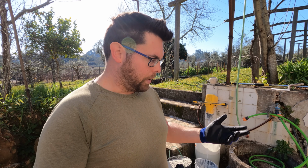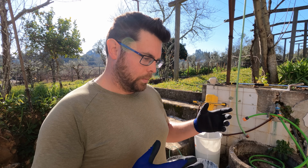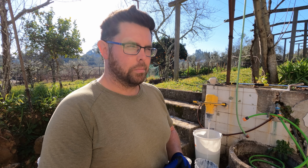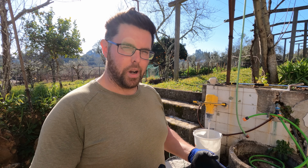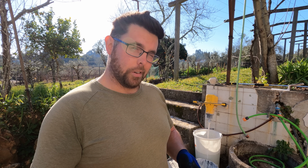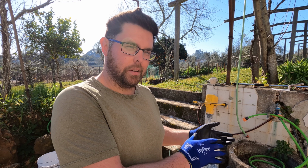So in the past, we've taken quicklime and slaked it into putty. We've hot mixed quicklime with sand to make a mortar. But the method that we're using now, because it's kind of the easiest and safest and most flexible, is using hydrated lime powder and adding water to it to mix it up into a putty-like consistency. But when the book says one lime putty to one sand for our top coat, I need to work out how many buckets of hydrated lime powder that is, and how much water to make up a bucket of putty.